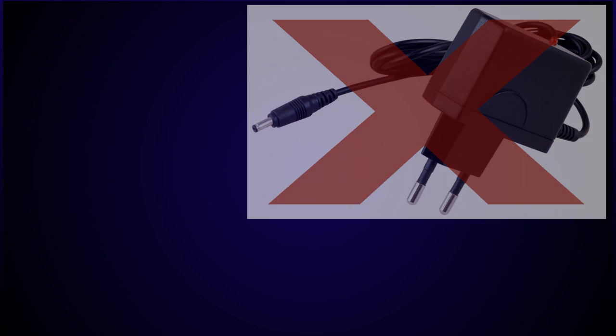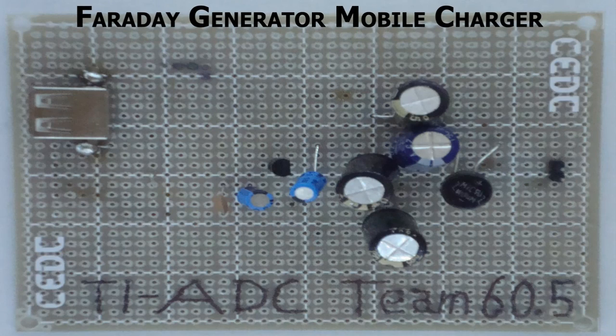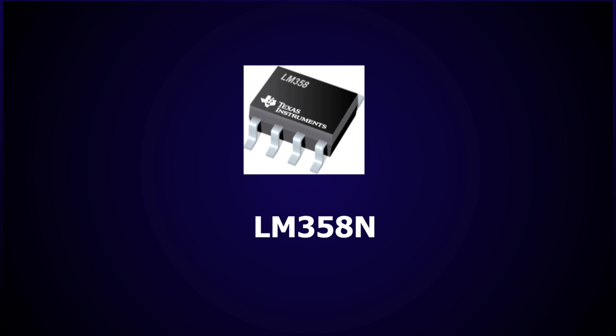This project addresses replacing batteries and power socket chargers with more nature-friendly and user-friendly equipment. This video explains the electronics involved and demonstrates the project's functioning. The TI ICs used are the MSP430G2553, an ultra-low power mixed-signal microcontroller, and the LM358N, a dual op-amp used as a differential amplifier for current sensing.